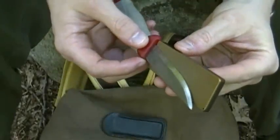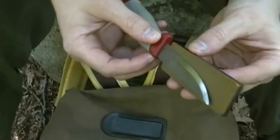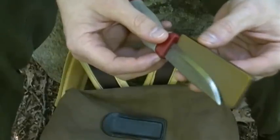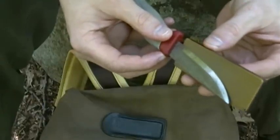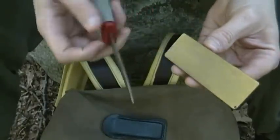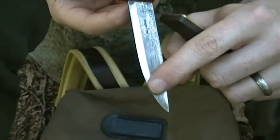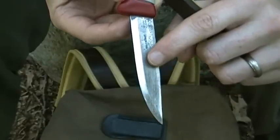All right, it's the same deal as before — it's doing it lefty. I want to have a perfect alignment with my bevel, very lightly, go over the edge. So as you can see, very easily where I've sharpened already, I haven't touched the tip yet. You can see all the patina and everything from here — all the tannin and resins — and the edge is just not keen like it is here.